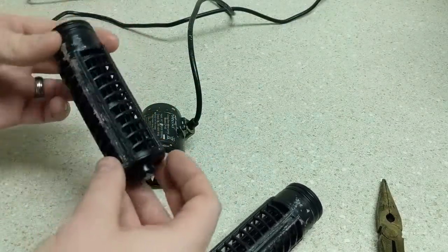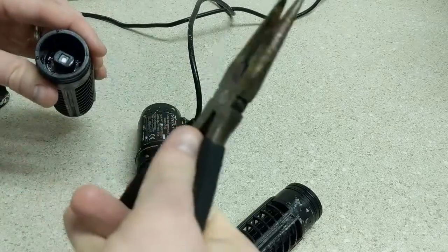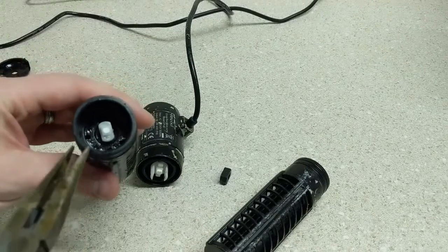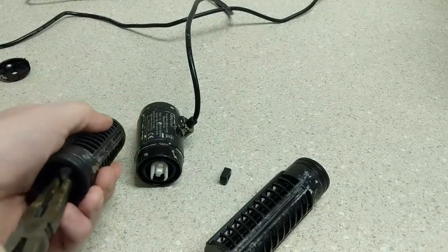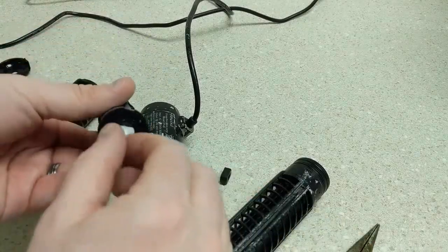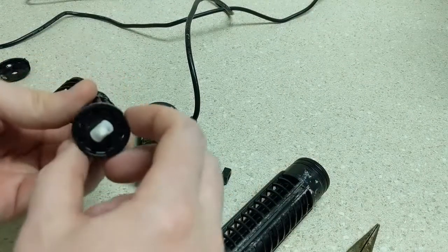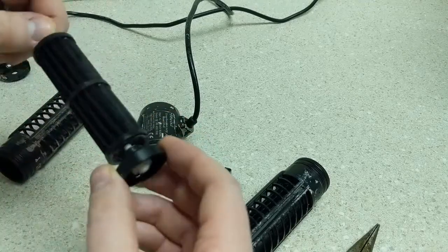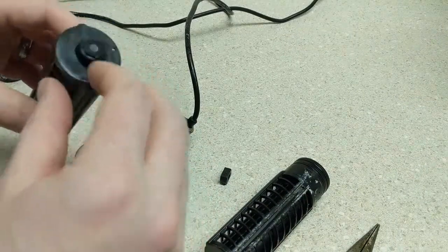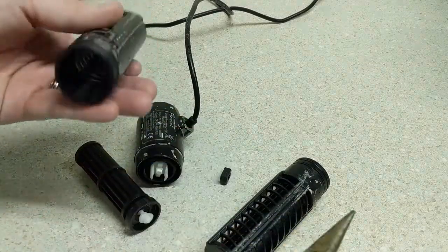So inside the edges of the fans, you'll notice that you have a little rubber gasket piece here, which might be easier to just take off with some pliers. If you grab this piece right here and you slowly tug out, the whole fan blade assembly should come out. This little white piece does come off with some serious force. I'd rather not take that off. So you can put a little bit more lubricant right in here and on the edge, which goes into here. You can pop out this white ceramic piece just using the tip of your needle nose pliers or what have you. A little difficult to get in there.